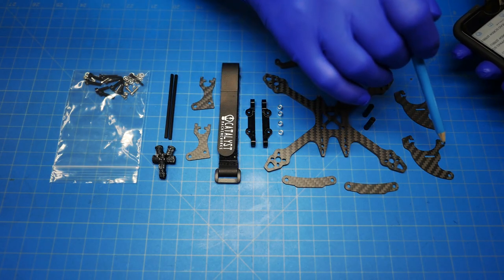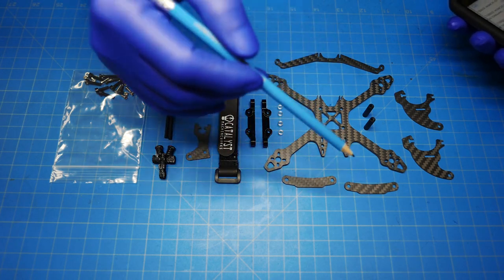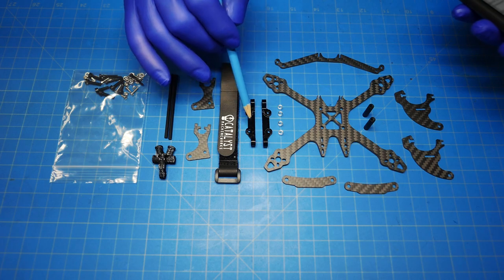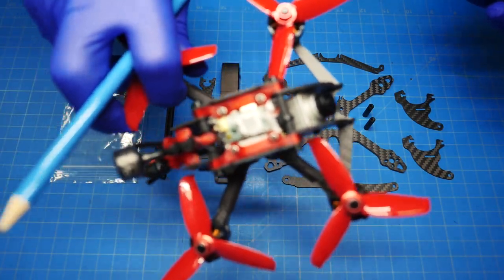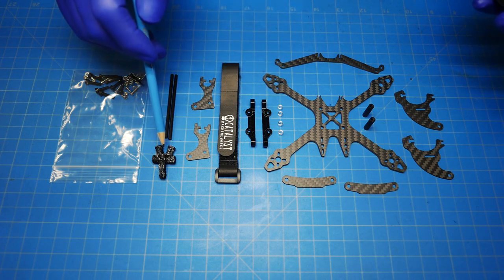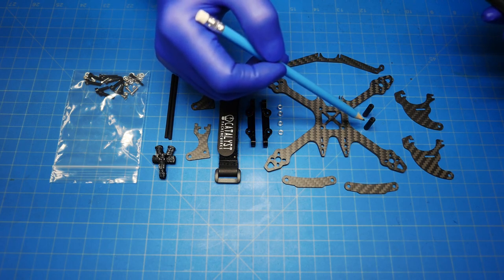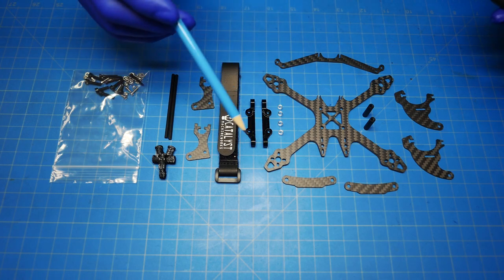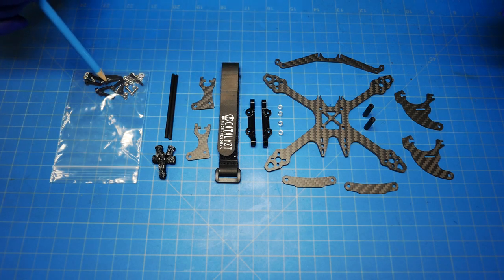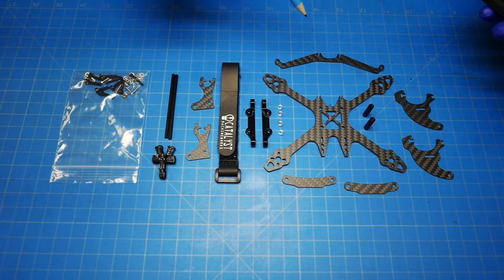So this is obviously the bottom plate. Then we've got the side cage plates — there's a front, middle, and rear, and obviously there are two of each. We've got the front brace, the Vista mounts — these are 3D printed TPU, left and a right. There's a black TPU antenna mount, the associated antenna tubes, a couple M3 aluminum knurled standoffs at 20 millimeters long, a Velcro strap, some aluminum sleeves, and a fastener bag. There are a few more parts compared to the original Massive Droner, and you'll see why in a minute.